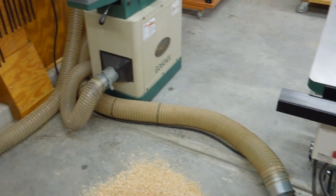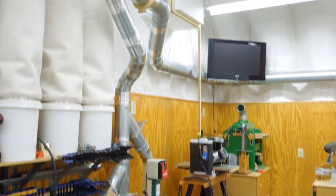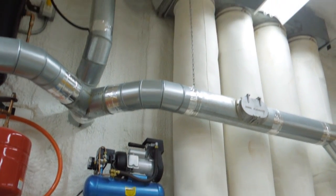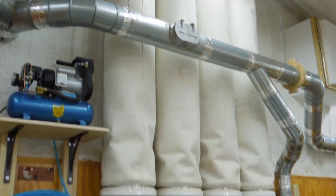This time we're going to pick up the same pile of sawdust. It's going to go into a 5-inch hose that came off of the table saw, go into the lateral, comes up, goes into the dust collector, the air returns into the plenum, and back to the shop.